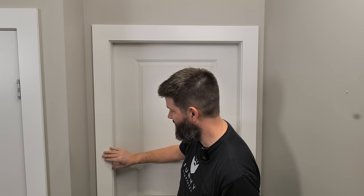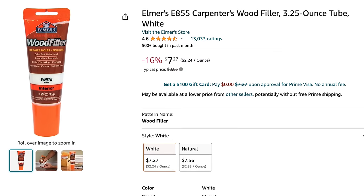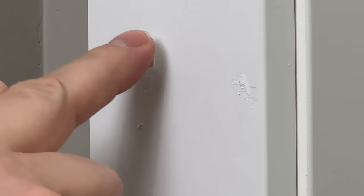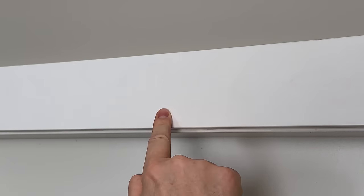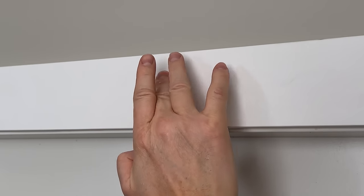The white is nice — it's going to cover easier if you're painting your trims white. You can get this at Home Depot or Amazon; I'll link it in the description. The real secret to a one-coat perfect application is to get the wood filler mounded up properly. Take the squeeze tube, put some on your finger, push it into the nail hole — make sure you push it in tight, and if it's not mounded up enough, take a little bit more and mound it up.